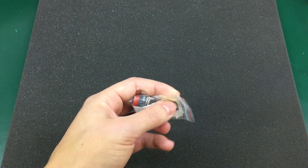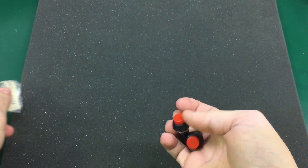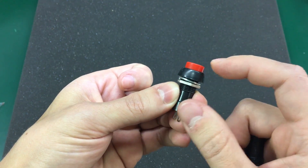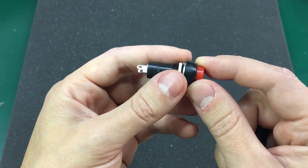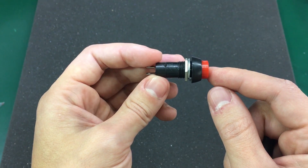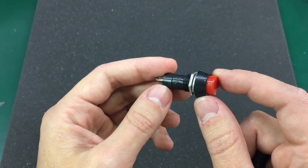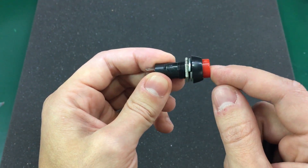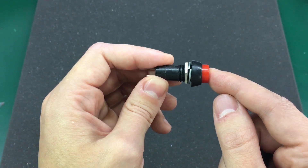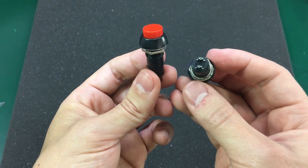Next, I have yet another type of switch, but this time it's a locking type switch, meaning you press it and it stays locked. It's a normally open type, so when you push it, it will make connection and stay that way until next press. This one seems to be mostly plastic with the same kind of round shaft for mounting — you just have to drill a hole. But this one seems to have a slightly thicker shaft, and according to the specs will require a 12mm hole for mounting. It's rated for 3 amps, 250 volts, and it just feels a bit safer to use on mains voltage than the previous ones. Being a locking type switch, you could use one of these for turning the output of a power supply on or off. I will put a link to these in the description as well.